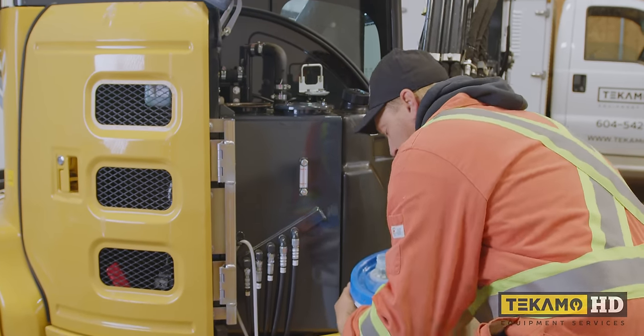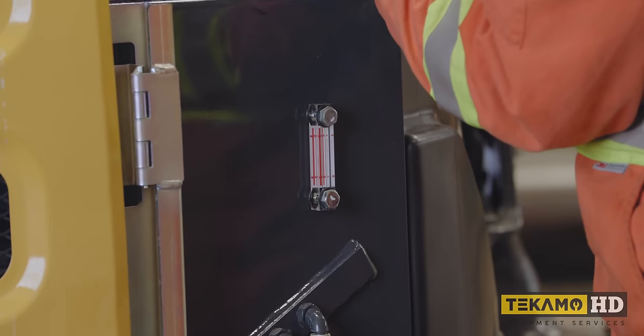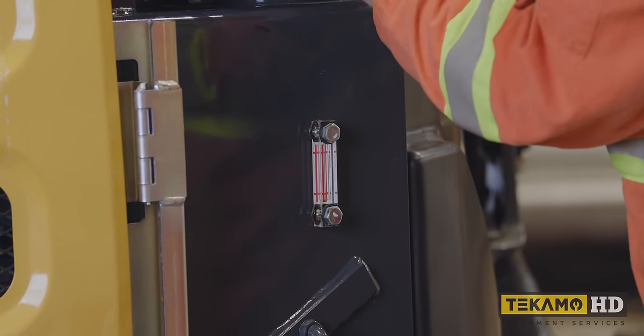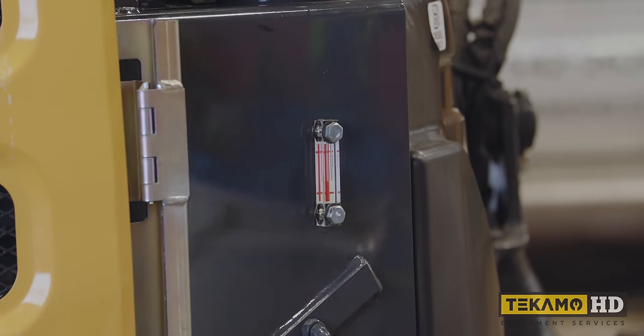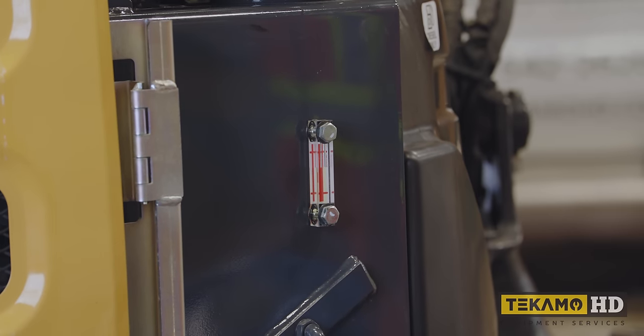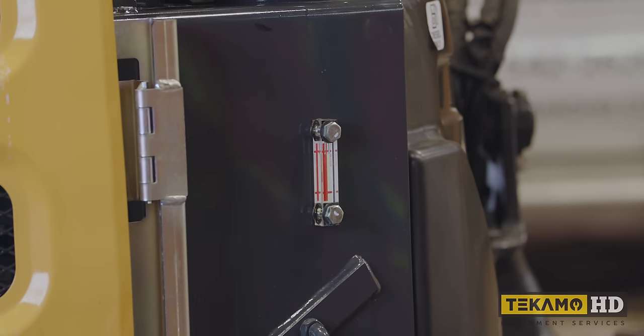As I get closer to this pail almost being empty, I'll really keep an eye on that sight glass. When you see it come on the sight glass, even after you stop pouring oil, it'll still come up a little ways. I'm on the sight glass now, and it's still rising. It's okay if it goes a little bit up, because we know once we fire it up, it's gonna suck down a little bit.